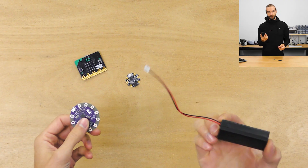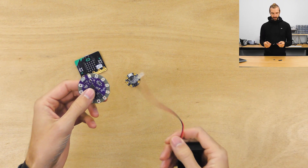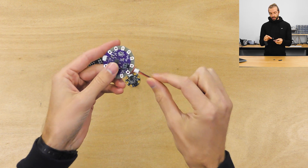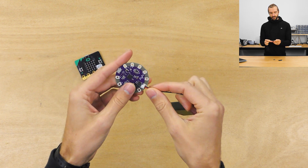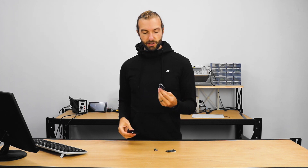Now there are some advantages and disadvantages to this. If you're using a LiPo battery, that's great — there's no disadvantages. But if you're going to use a standard battery pack with AA batteries and you connect it to USB with the battery pack connected, it's going to put power into your standard alkaline batteries, which can cause them to become damaged, start a fire, or something else unpleasant. So you need to be careful with boards that have charging built in if you're not going to use LiPo batteries.